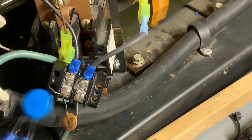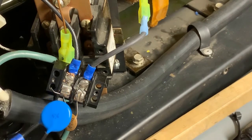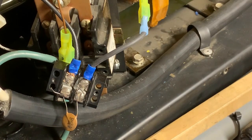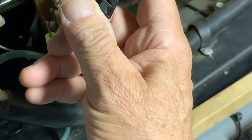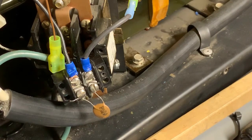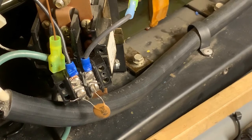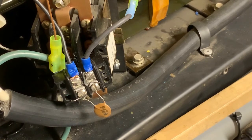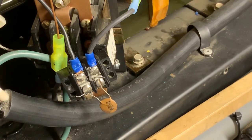I keep mentioning that I want the relay to sing, so after thinking about it, I came back and changed this capacitor out. It was like 10 nanofarads, and I put in 0.005 microfarads — so there's hardly any capacitance — and it's going to make a difference. I'm going to demonstrate it, and you'll hear the sound I'm looking for. If that sound isn't there, we don't have much. You hear that? So that's a basic thing, and it may come down to this capacitor. I'm an experimenter, so now we've got something we can test.